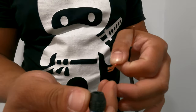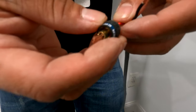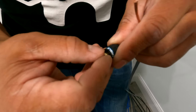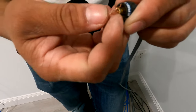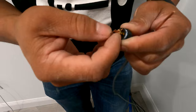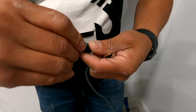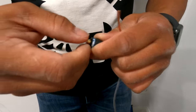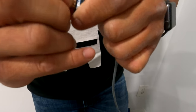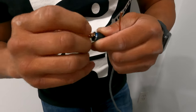Let's get into the termination. We're gonna shoot the wire through — we need the wires to protrude, and we want the jacket to exceed the end of the plug itself. Shoot it through about a quarter inch until you have about a quarter inch of wire extra, then proceed to umbrella the cables. This wire is particularly hard to deal with because it's very thick gauge for audio cable. Normally with a lot more strands, you push and all the wires just umbrella right over, which is nice. The whole goal is to get them folded over the top.